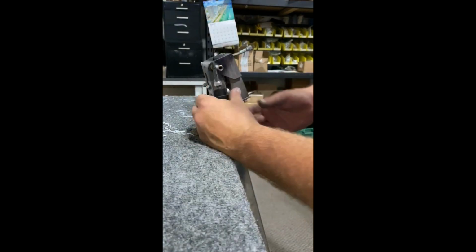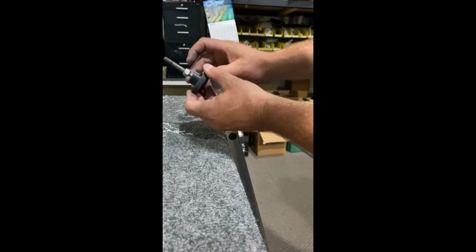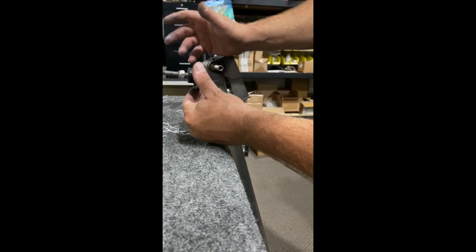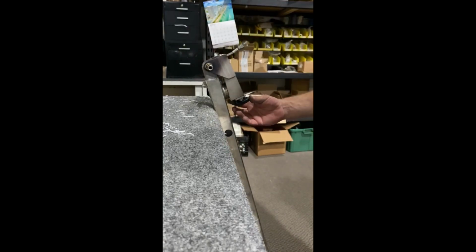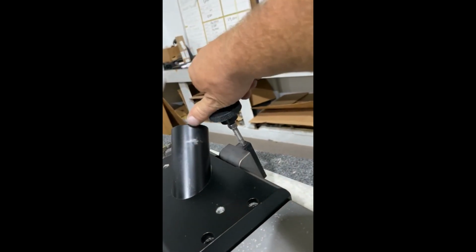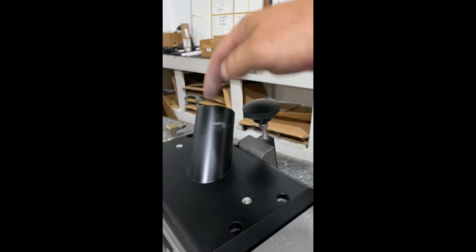See what I'm showing. So if you have to turn it 1 or 2 times and then it starts to grab, it means your nut has loosened up, and that's normally because you don't loosen it and you try to keep turning this without loosening your back lock nut. And just to tighten it up, if there's any play, it goes between that steel plate. So basically, it's on the head here, which when I screw it in, I leave about 1 inch of thread when I go to put this back on. It gives me a starting point.